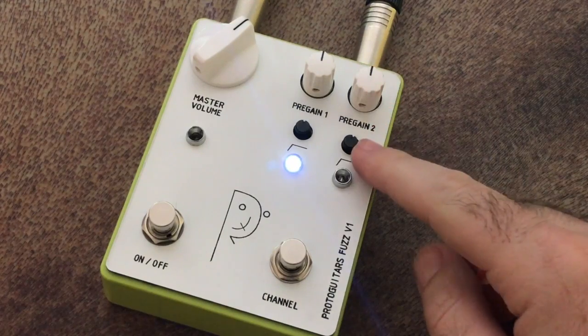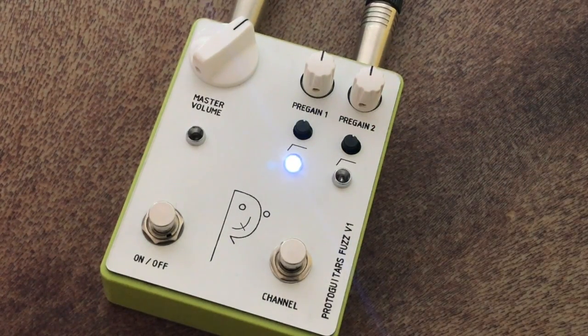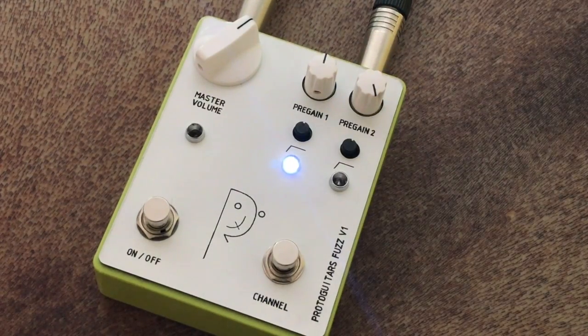You have a pre-gain and a bass roll-off tone control. The concept is that the fuzz is actually on full inside — like you'd run a fuzz face on full, or a tone bender often on full, and then adjust your volume from there. But that doesn't always work if your pedals are in a buffered loop, or if you use wireless systems, or maybe you're just not great at using your volume knob. You end up not getting access to all those great rolled-back fuzz tones. So when this is on max, it's as if you're playing into a fuzz face on max with your guitar volume on max. As you turn this down, it's more the equivalent of turning down the volume on your guitar than turning down the fuzz on a fuzz pedal.